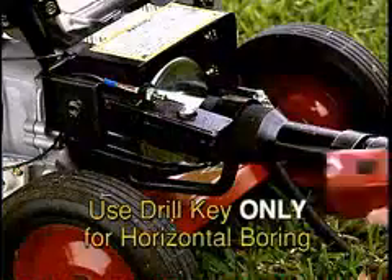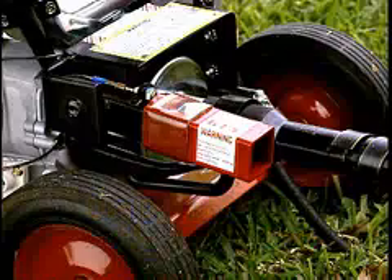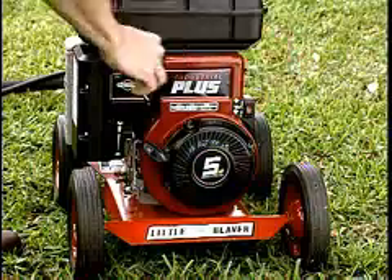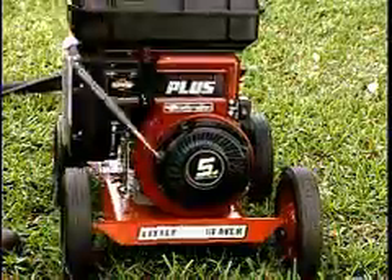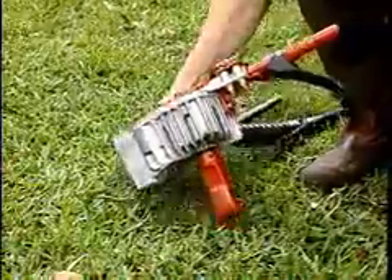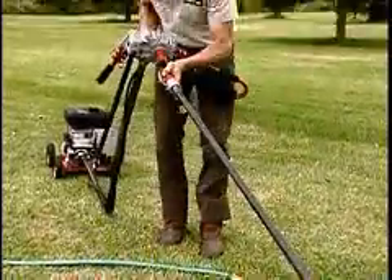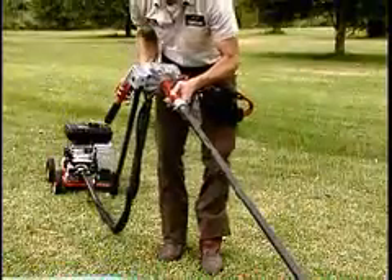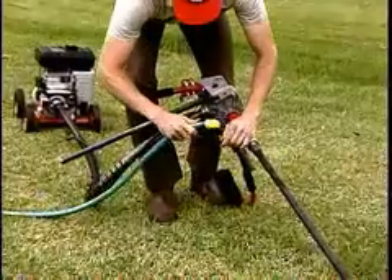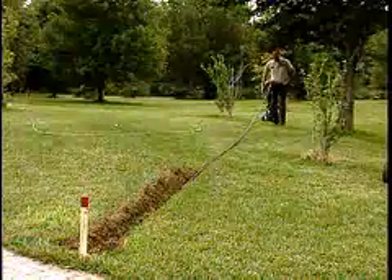Install the horizontal drill key in the torque tube connector on the power unit to allow the engine to operate without the torque tube. Start the engine and allow it to warm up. Slow the engine to idle and confirm that the auger adapter is not turning. Install the swivel drive adapter to the auger adapter on the auger handle gearbox and attach a water hose to the hose connector. Turn on the water.